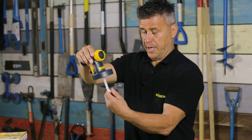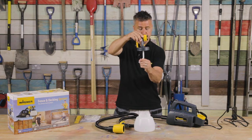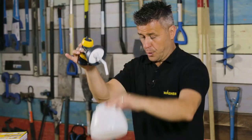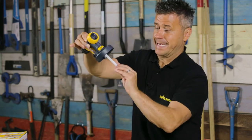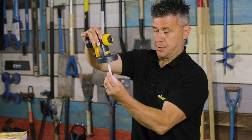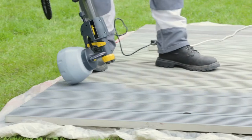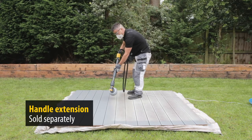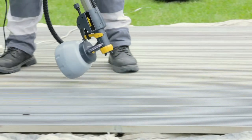If you're painting anything above your head you'll need to position the suction tube to the rear and spray at that angle. But if you are spraying your decking you will need to turn that suction tube forward when spraying down towards the floor. There's also a handle extension which is ideal for hard to reach areas like decking or ceilings.